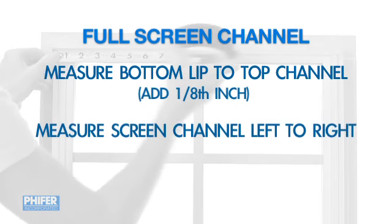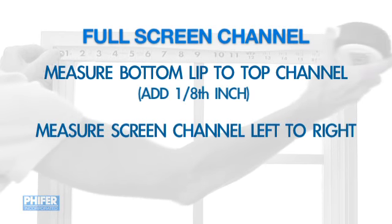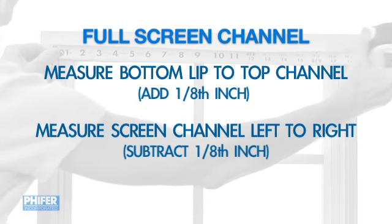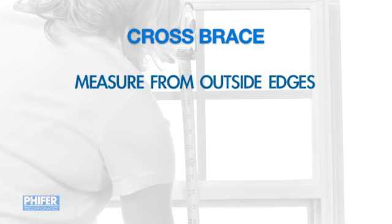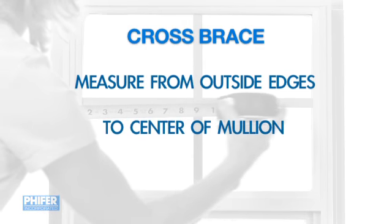Measure the width the same as you do for the bug screen, measuring the screen channel left to right and subtracting 1/8 of an inch. Again, be sure to note what type of mounting hardware you need. If you want the optional cross brace or colonial grid pattern, measure from the outside edge of your screen to the center of the mullion.